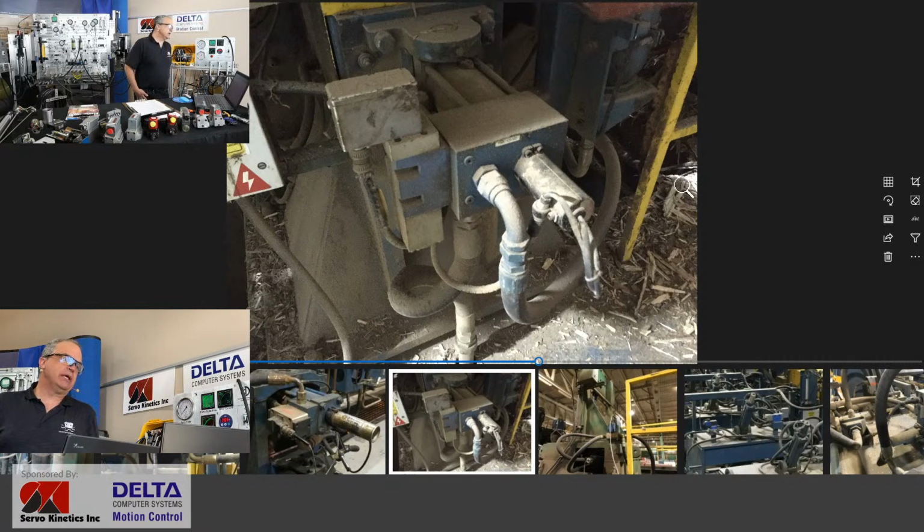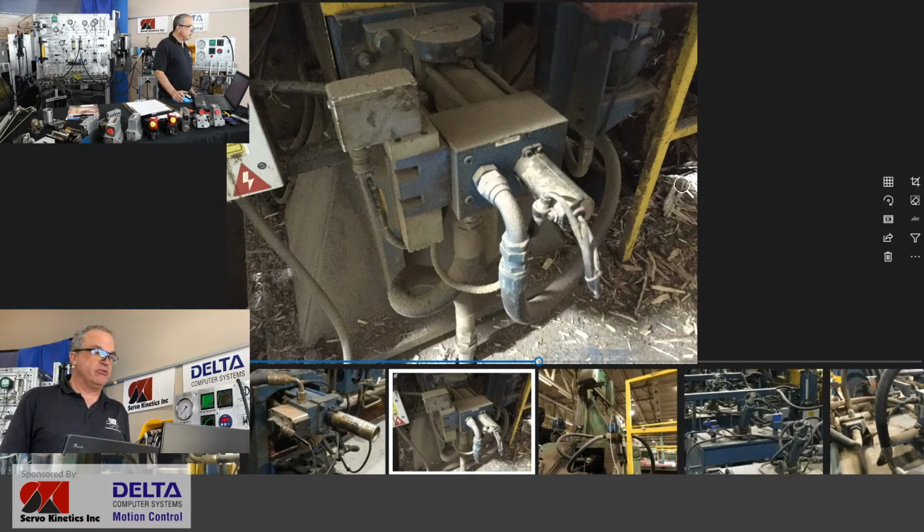Here's the first time we're seeing a direct drive valve, a linear direct drive valve. That earlier one that was cylindrical in shape, the second photo, was a rotary direct drive valve that we'll have a look at. This one is a linear direct drive valve, and that's becoming very, very popular too, where the solenoid, in some cases, manufacturers like Parker referring to their coil works as a voice coil, similar to what you would have in driving the magnet and cone of a speaker, and a number of manufacturers producing valves where the solenoid element is directly driving the spool and there isn't a pilot stage. And that is what you're seeing in this particular instance.